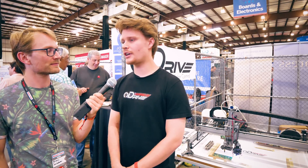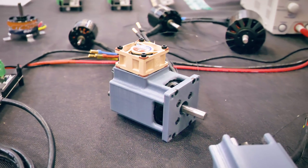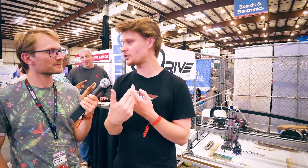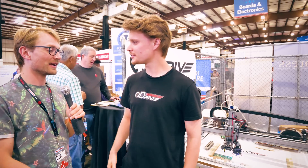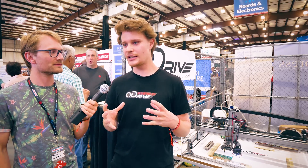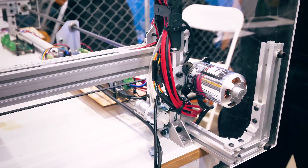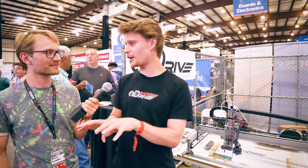Yeah, absolutely. Our next product is going to be a little board that sits on the back of a brushless motor with the encoder all built in. You basically just feed it power and some form of control — my personal favorite is CAN bus, so you can network motors all around and get feedback from everything. But there will be a step/direction input as well — straight up plug and play. Thanks for making it open source. My hope is that people who want to build heavy battle bots motor controllers can take the design, add some really beefy FETs and it should work — we've written the software modularly so you can replace the low-level support package and the rest just works.